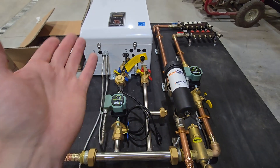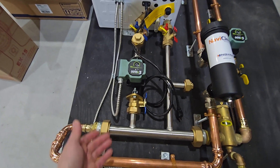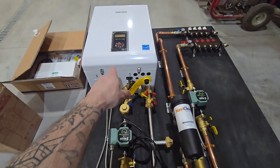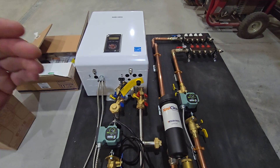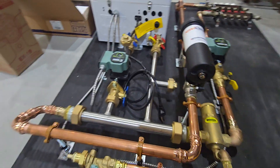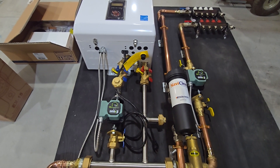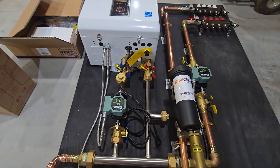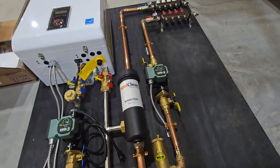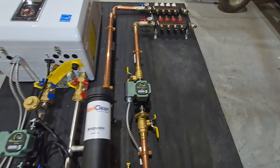The other difference is the manifold. These heat-only versions do not come with an internal pump for the primary loop. So the manifold that you purchase comes with the flanges in order to be able to add on a system pump. You need to size the system pump accordingly to the size of the unit that you purchase, based on the BTU requirements the boiler provides. That is identified in the manual — it'll tell you what size pump you need for various different brands. In this case it actually is a 0015. You can adjust the speed accordingly as well. I also sized the pump with a 0015 on the secondary loop — that's what this circulator is here. We'll probably run that on high for this situation.